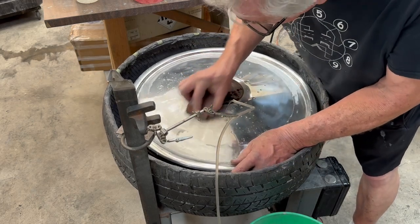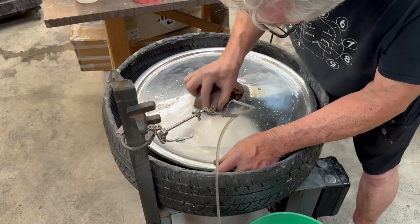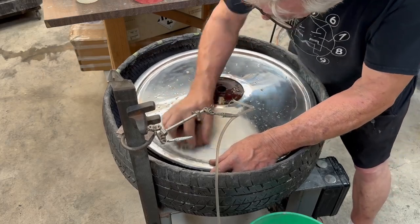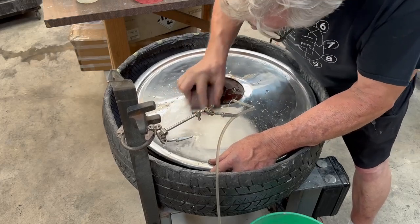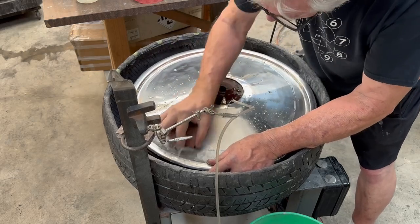The nice thing is I can see them come out. That's why you call this color sanding — because the color below is from the more coarse grit papers that have occasionally left anomalous radial scores. And we have to get below them, of course.